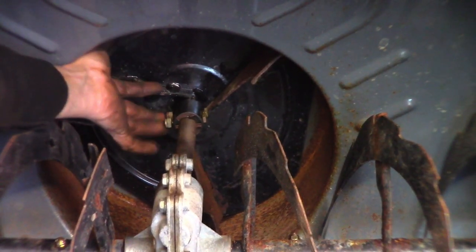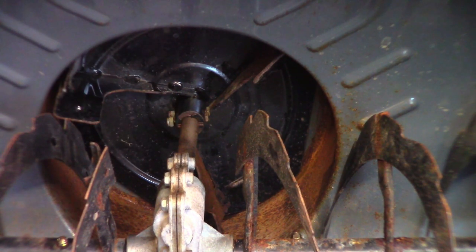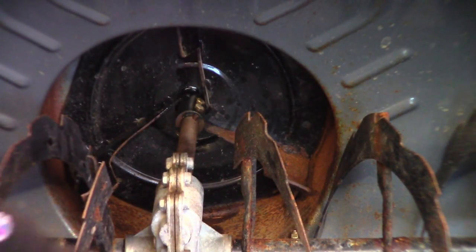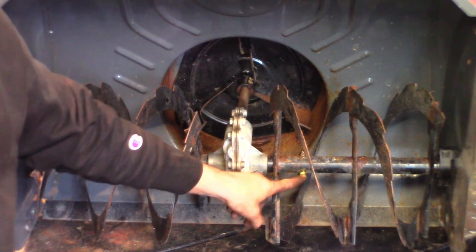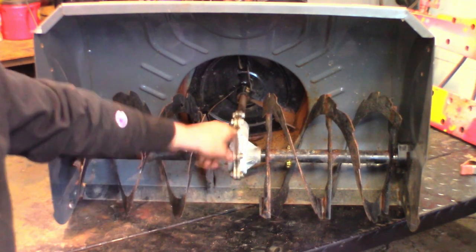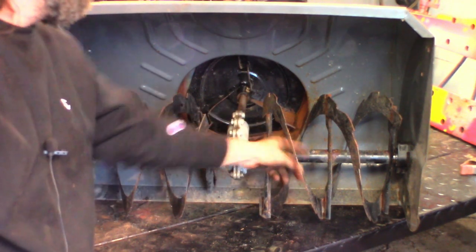You can see these two bolts here - just got to tighten those up. On one of the machines I worked on they were actually shear bolts, but on this one they're just regular quarter-inch bolts. 7/16ths socket and wrench - just reach in there and run these down. You can see our new shear pin there - one there and one on this side. While I had it apart with all the augers out, I cleaned the stub shafts from the gearbox. They're only about four inches long - they only go partially into the tube, so I cleaned and greased them on both sides.